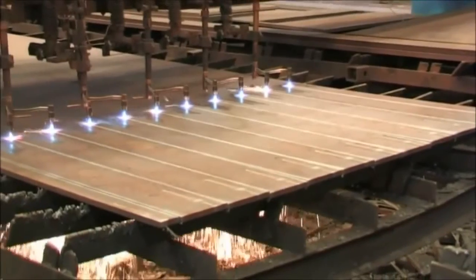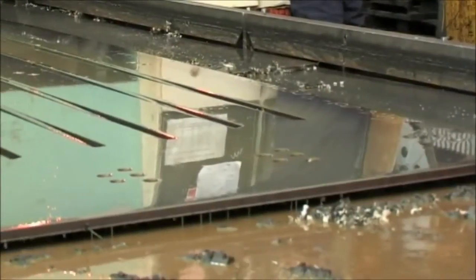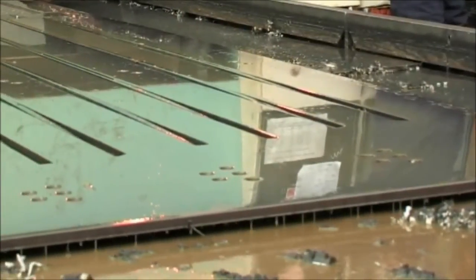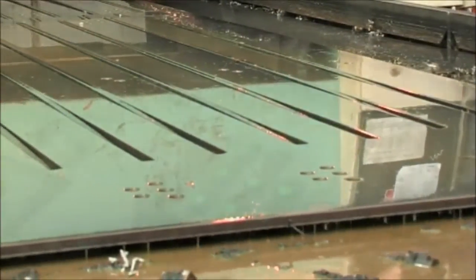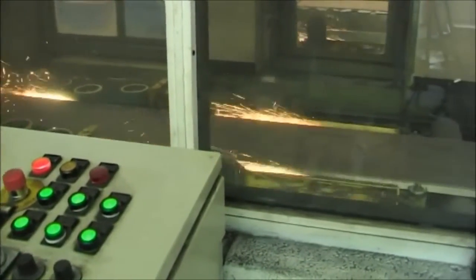The system allows the accurate fabrication of girders with curvature in both plan and elevation by cutting the relevant components to the final shape prior to assembly, thus avoiding beam rolling or bending costs. Following profiling, flange edges are ground by machine to a smooth radius.